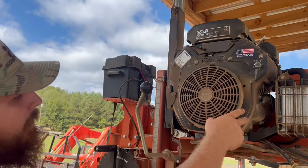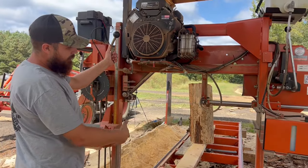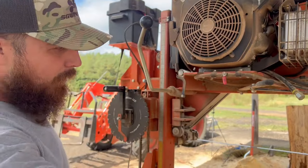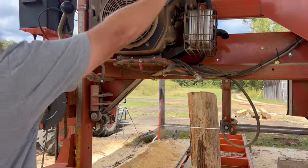So we went ahead and raised the head up all the way, which on my mill, which is a large, wide head mill for big diameter logs, I can go up to 35. So my first one will be a little thick because I didn't measure. I just blopped it off at like 4 feet there. But every cut after that will go 1.5 inches.